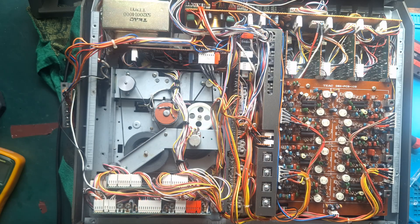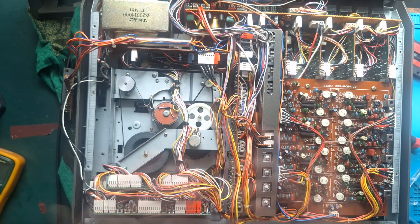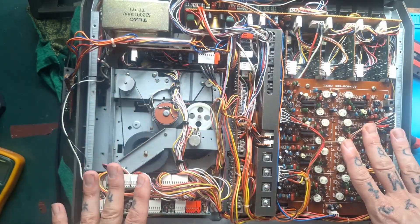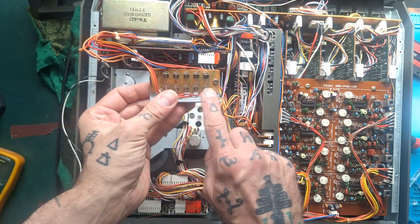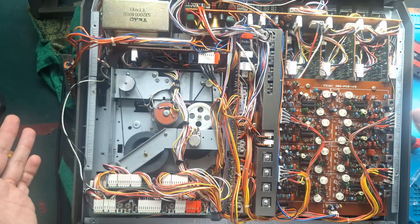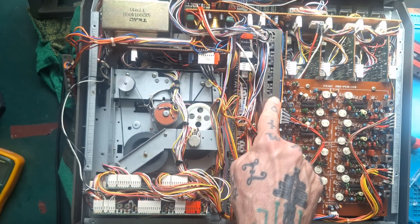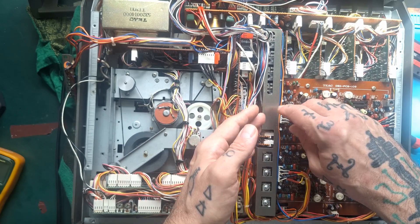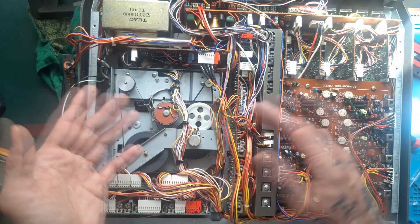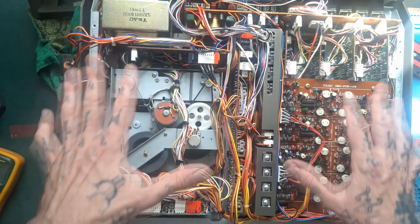What I'm going to do — which should protect the circuits with the slow-blow fuses and ideally only cost a few pounds for a packet of fuses — is start with the power supply board disconnected from all the boards powered by the rail that's blowing the fuses, then plug them in one by one and watch for the fuses blowing. The point is not to find exactly where the short is, but to narrow down which board it's on, because this is a very time-consuming model to disassemble. The modular design is a blessing in some ways, but in a situation like this it's a curse. It would be easier on something like a 244 Mk3, where the system is distributed across far fewer boards.